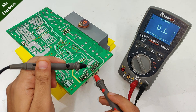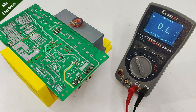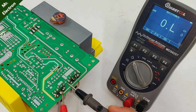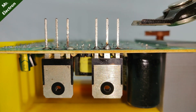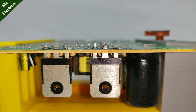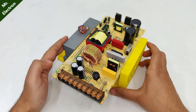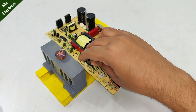After completing the soldering of the transistors, perform a continuity check to make sure all the pinouts have been connected properly. Also do a continuity check on different pinouts to confirm there is no short circuit — it looks good.